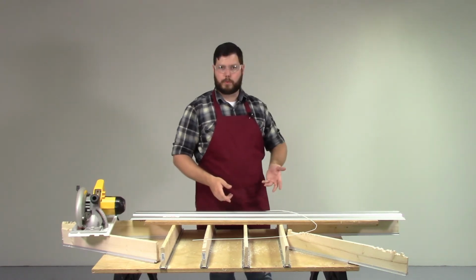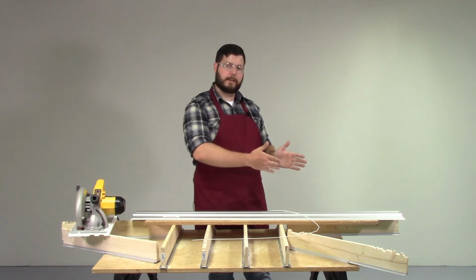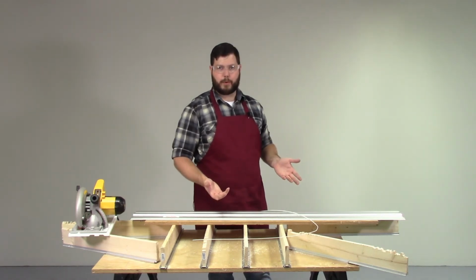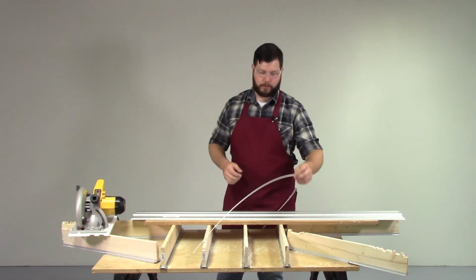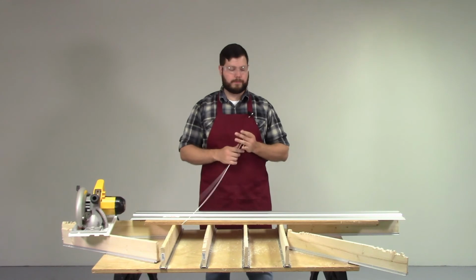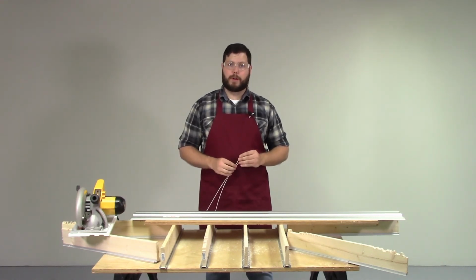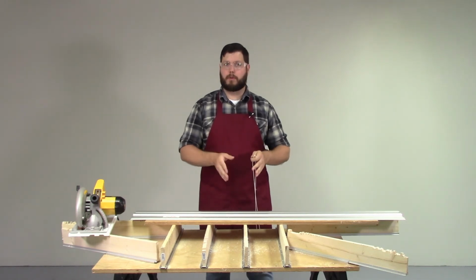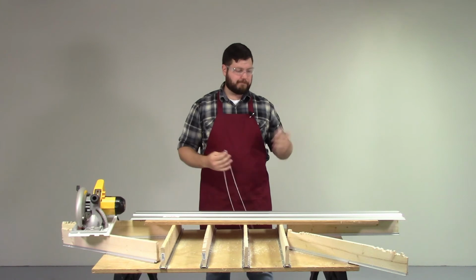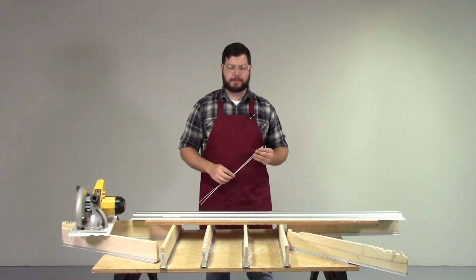But for most of us, we just go until the front edge cuts through it. If you're toed in, the front edge is making the cut anyway, and the back edge really doesn't do anything. So you really won't notice any variation if you've got it toed in. Toeing it in is also not a bad thing. It mimics what you do on a table saw with your table saw fence, by having the front leading edge be a little bit closer than the trailing edge. It makes it nice because there's a little bit of leeway in the system.